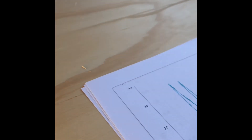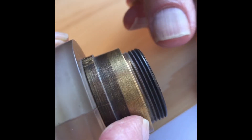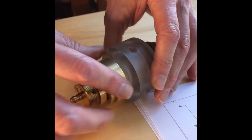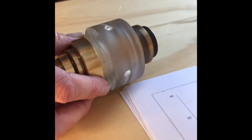That part keeps falling down. This is the part that actually screws into the top plate. So the border between the outside and the inside of the switch would actually be here. If we screw everything together, this sticks out considerably more. So what we're talking about is a short circuit that goes from this part to this part, so some of the current would not flow through the switch at all, but would flow directly to the anode.